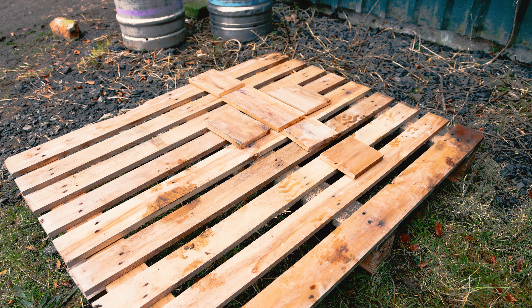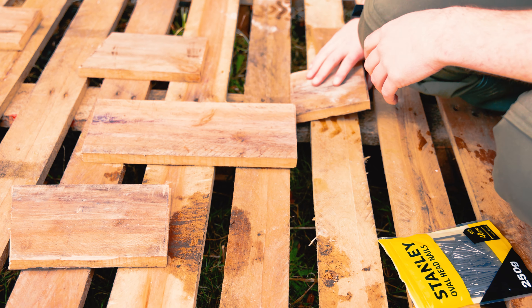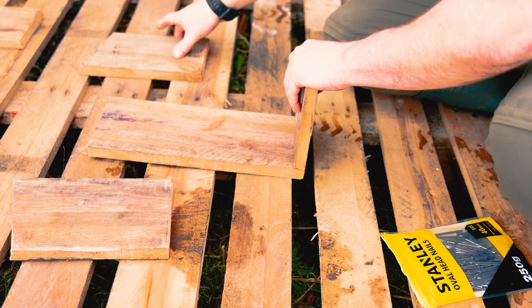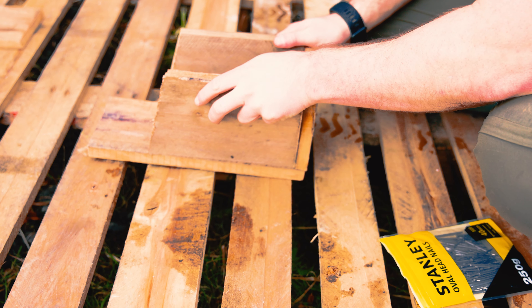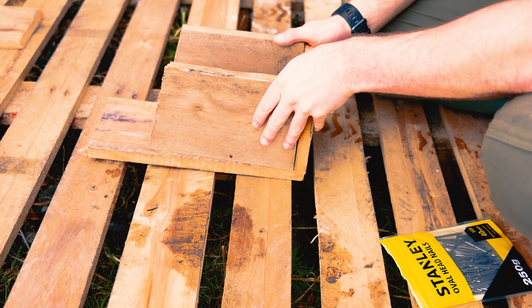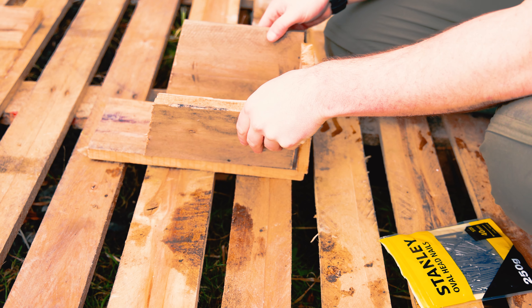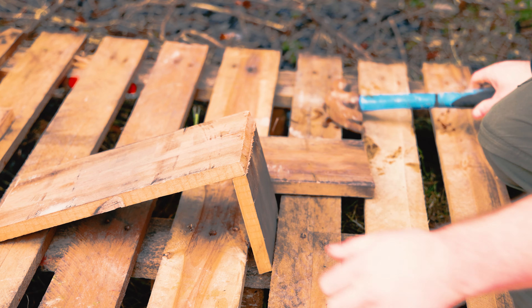The description and heights of everything are included down below, but just as a refresher: all you need to put this together is a hammer and a set of nails. For the back panel you'll need 300 millimeters by 150. For the base panel you'll need 120 millimeters by 150. For the side panels you'll have them 200mm high at the back end and 175mm at the front end. I'm now making sure all my pieces of wood line up exactly where I want them with no need for filing or sanding. For the front panel you can have that at 150 millimeters or 100 millimeters, and for the roof it is a 200 millimeter roof with a bit of an overhang just to protect the entrance to the box.